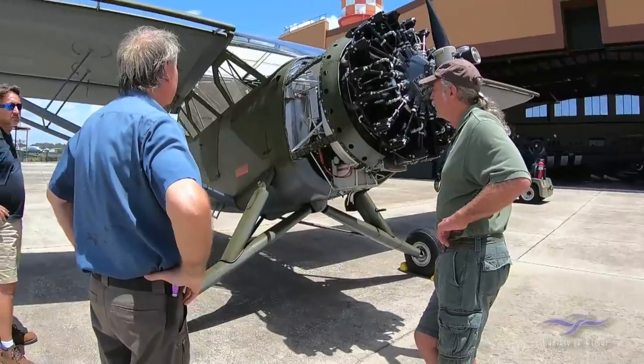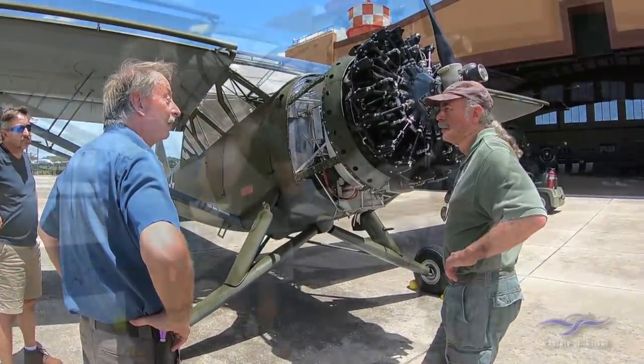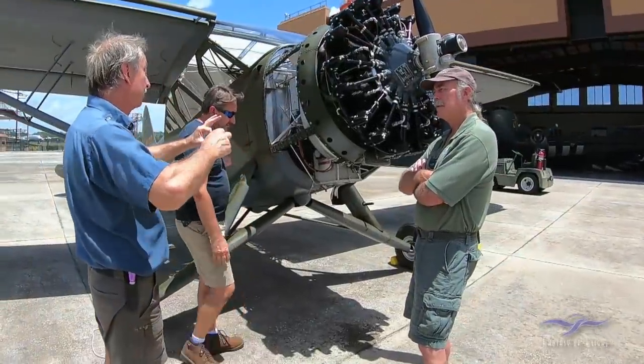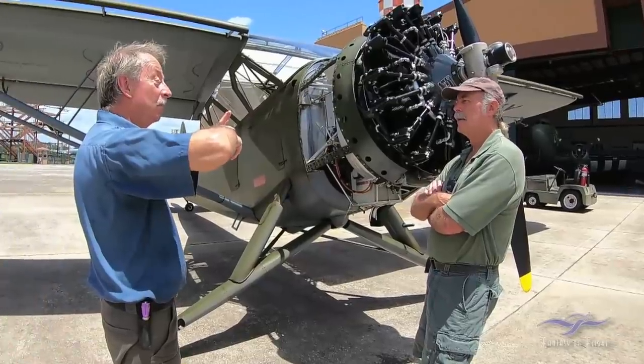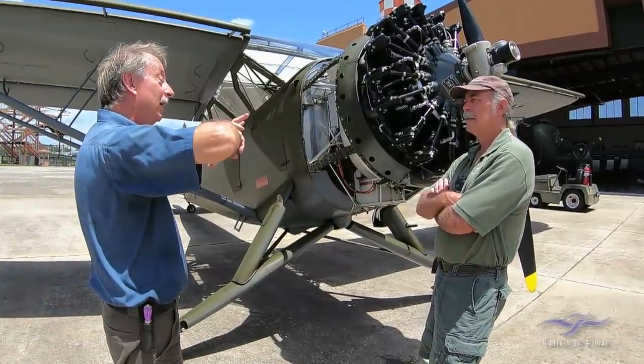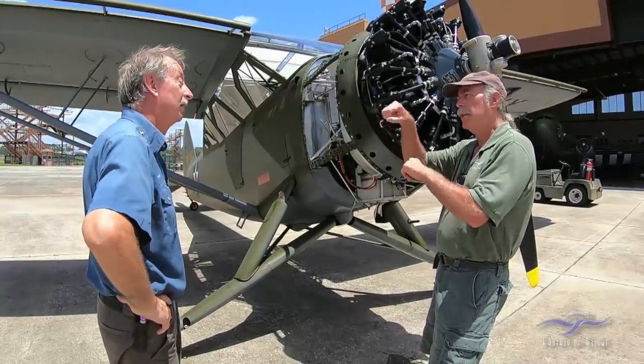It just gives the impression that it's incorrectly timed, which means that something is not turning something else. This is pure speculation, but if you can imagine a shaft on a wheel, a shaft with a key in it, maybe when the engine locked up, it broke the key. You know, we've retimed it, and it's just spinning and not turning the other thing.